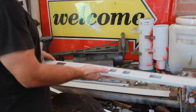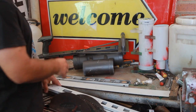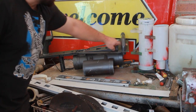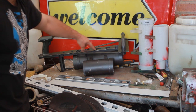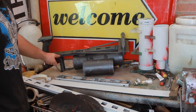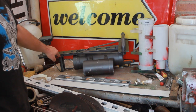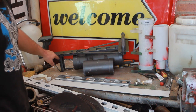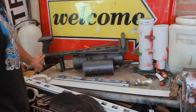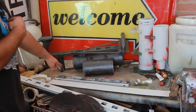Basically, I'll show you right now - this bit is the main body part. What happened was, it starts here, goes all the way along here, and then it bends downwards. And because aluminium, once you bend it, it's very weak at that point, I didn't want the handle laying on this bend part.